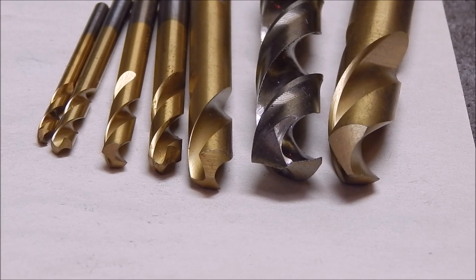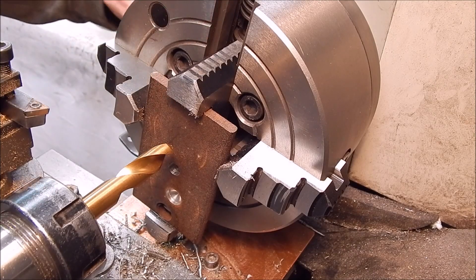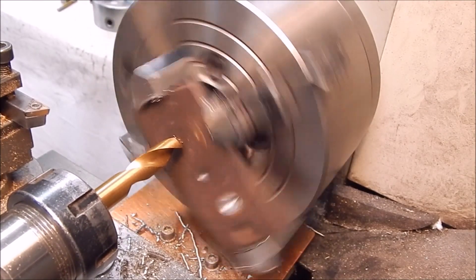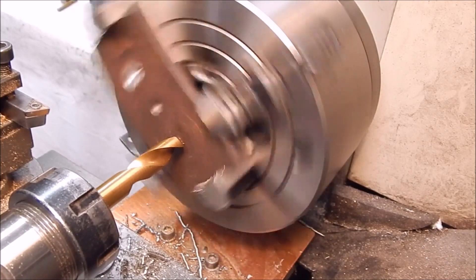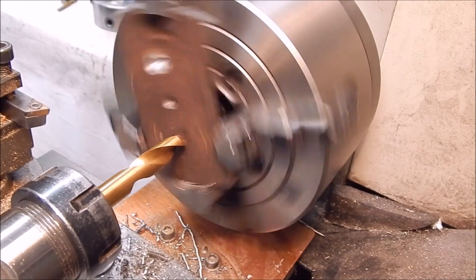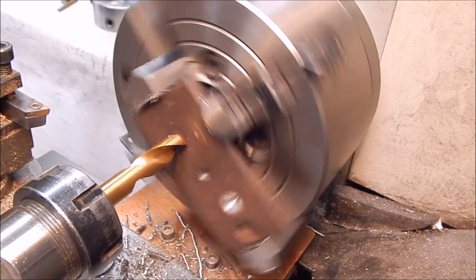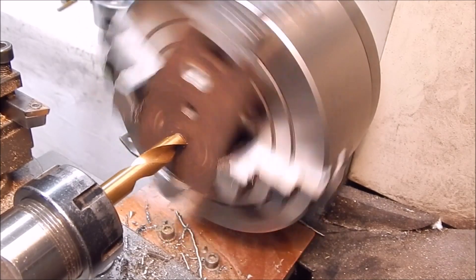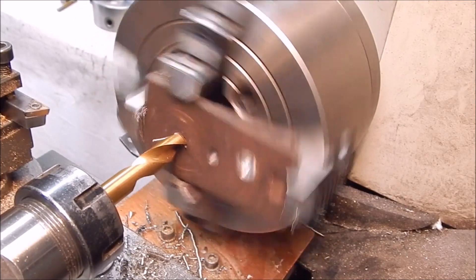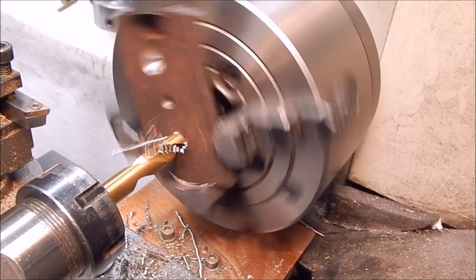The best thing to do now is try them out and see how they perform. Here's the 90 degree tip in 12mm - let's see how that goes. Running at 143 RPM. You can see the old lathe is under a fair bit of duress here - this is hard going, spring steel, lathe is in bottom gear. I'm getting some belt slippage; the belts are tight so it's really grunting. The grind on the tip looks pretty even, which is good.